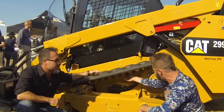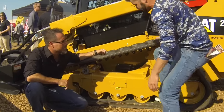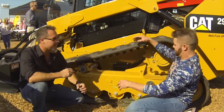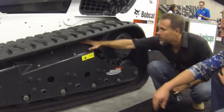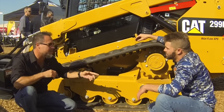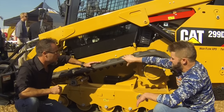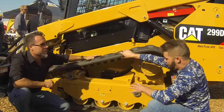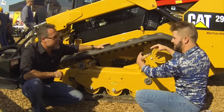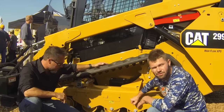Think of all the stuff you've got up inside here — this is all open space. We have a thin layer of mud that just rides and wears these teeth and sprocket out. I love that this should be self-cleaning, and if it's not, I can just easily kick it. It'll be a weak point. The Bobcat's tough to kick because it's really packed in — you've got to get a flat shovel or pry bar and scrape it out, and then you're also hitting the teeth on the bottom because you don't have a lot of clearance. On the Bobcat, we take a piece off, pump a grease fitting, it tightens a piston, and that tightens the track.